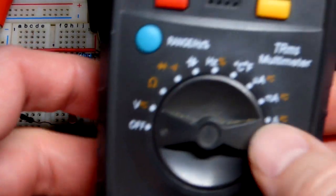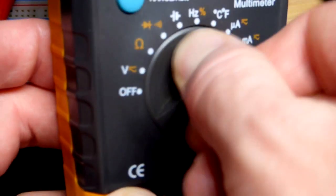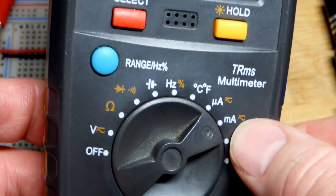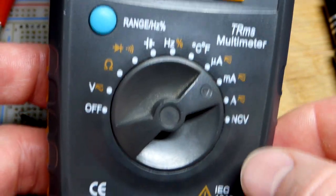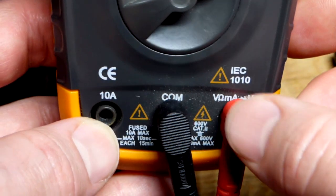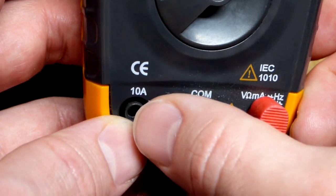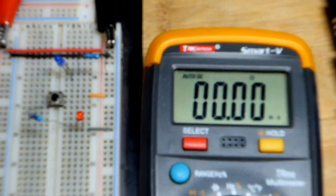This is an auto ranging meter, so it's a little more complicated than other measurements. We still have a range we have to set it to. It's milliamps though, but I think 600 milliamps is the absolute max. So I always check out the max there, but it will be low milliamps of current. You put the red probe where it says milliamps. The only time you usually change it is if it is high current, which really you shouldn't be measuring until you really learn how.